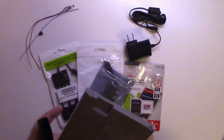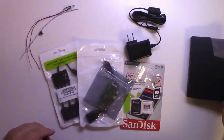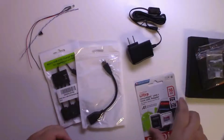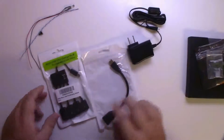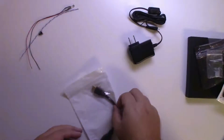Let's start with what you'll need. First you'll need a NES cartridge — this one is an official NES licensed cartridge and it does require a special screwdriver to open. You'll also need a Raspberry Pi Zero, a heat sink, a 16 gig class 10 ultra micro SD card, an HDMI to mini HDMI adapter, a USB OTG charger hub (make sure it has the OTG option), and the charging cable for the Raspberry Pi. All links will be in the description below.